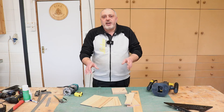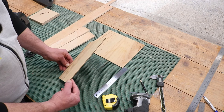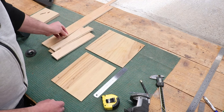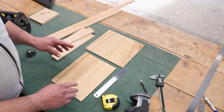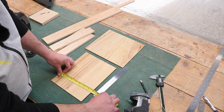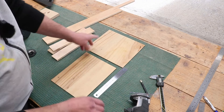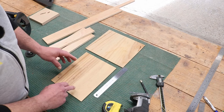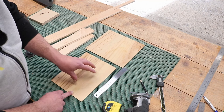I'll bring this in a bit closer and show you what I'm going to do. To make these I have just a couple of pieces of 3mm plywood and some off cuts of 12mm plywood. These strips are around 50mm wide and these ones are around 70mm wide. The size of the plywood — this one is 250x198 and that one is 220x250. But that doesn't really matter. The part that matters is the section that we're going to be running the router in to create the T-slot.